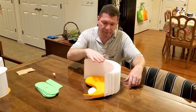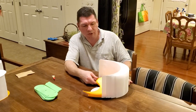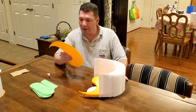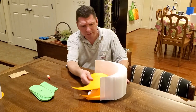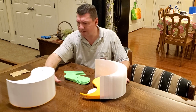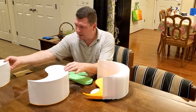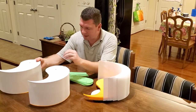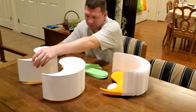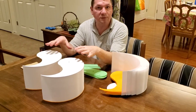The scoops will come with all the bottoms and sidewalls pre-made — it's going to be injection molded. These are 3D printed obviously because I'm prototyping and testing, but doing it this way makes it a lot easier. I don't think we'd have the ability to get a shape like this injection molded completely, and even if we did, these parts wouldn't nest together because they're all the same size.